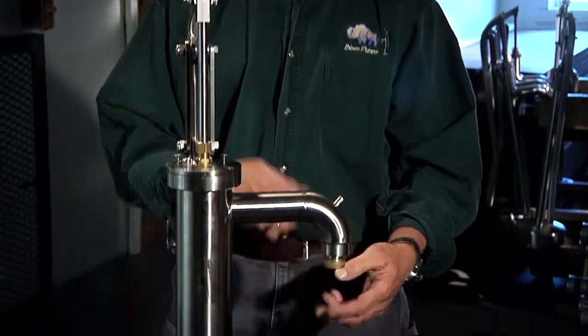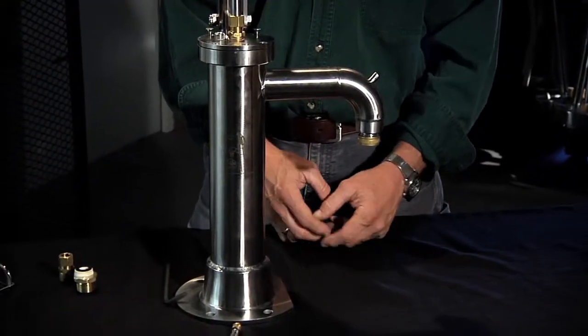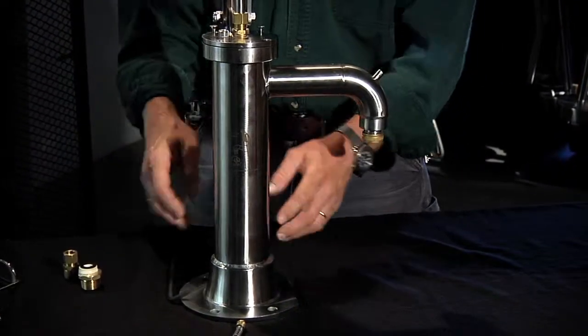Then just start pumping your pump. You'll see the color of your antifreeze — it will either be pink or green or yellow, there are several different colors. You just keep pumping to evacuate all the antifreeze. Once you start getting nice clear water, then you're ready to use your pump. Do the same thing again when you leave: you winterize your pump, same process in reverse.